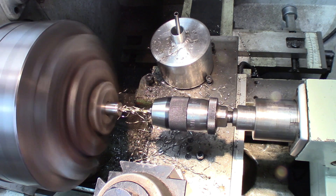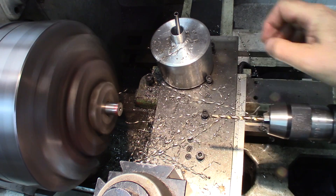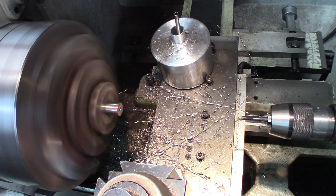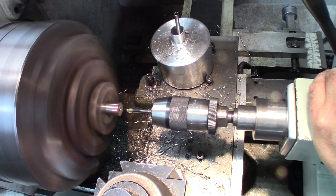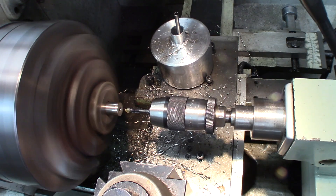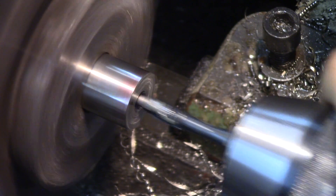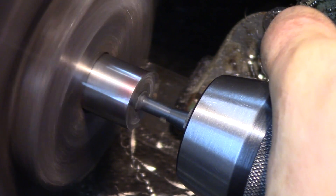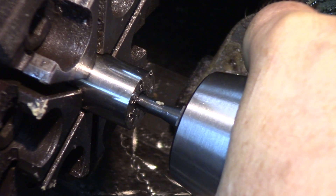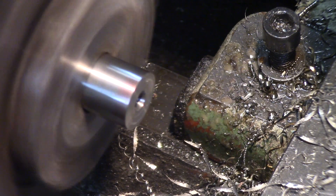It's starting to jerk — perfect. When it starts to jerk you come out of there. Who wants to tap a quarter-twenty one inch long by hand? Not me. So we're going to use this chuck as some kind of a tapping head — I'm just throwing it in. 650 RPMs — it will slip at the end. Reversing. That's done.